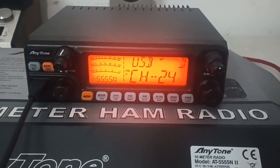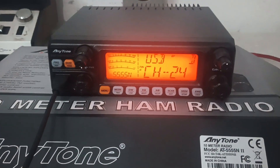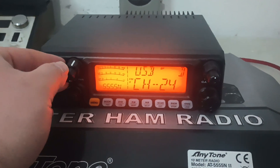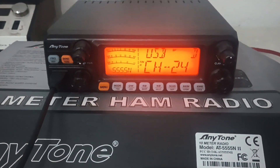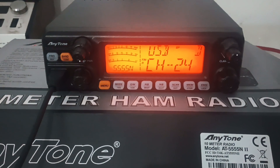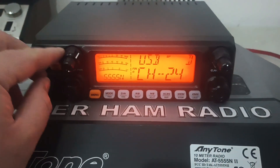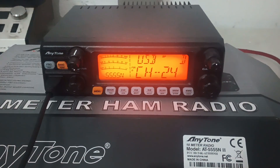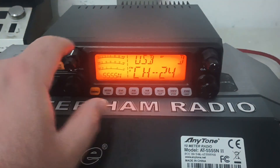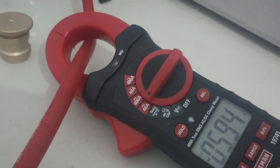That's why people blow stuff up sometimes when they go to sideband and think, well, I'm just going to turn RF power wide open because I have no dead key on sideband — so it doesn't really matter where I run this. 100 watts PEP is 100 watts — that's not true. There's a difference between 100 watts PEP and 25–30 watts average versus 100 watts PEP and 80 watts average. And when it was wide open, we were drawing 9–10 amps. Now we're drawing almost half.